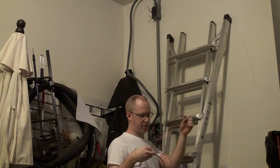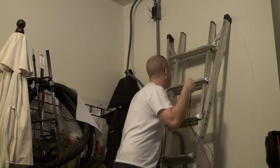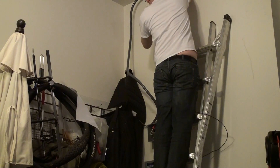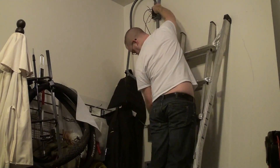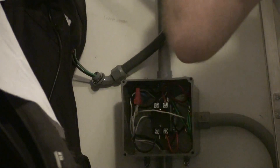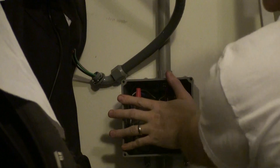It's 10 gauge wire. For some reason I only bought the ground separately, but I've got a red and a black — two hots. This unit doesn't use a neutral. I'm going to fish those downwards from the top box. You could use a wire fish if needed; I don't believe I'll actually need it — it should be fairly simple. You'll see me moving the wires from the top to the bottom. I don't have a fish tape; I've got those fiber sticks but they don't really work in conduits. That should complete the contactor wiring — looks good, no real issues. We'll close this up and that will stay closed.